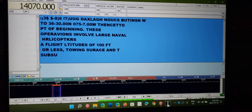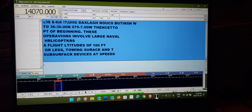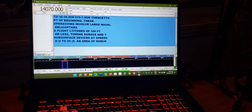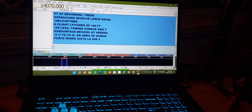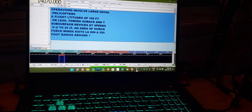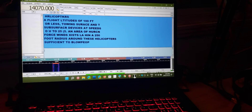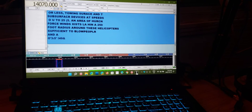When we talk about performance, performance is uneven on devices. There are frequency ranges where devices perform better than others. I don't think we can say one device performs better overall everywhere, but definitely some devices perform better on some frequencies than others. What I see here is that the AirSpy HF Plus seems more sensitive on those lower frequencies.